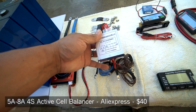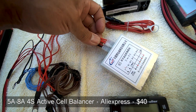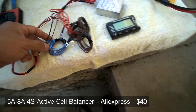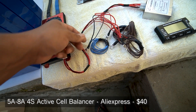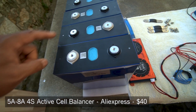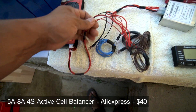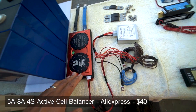This is an optional dedicated active cell balancer, about $30 to $40. It works similarly — it has five leads: a common negative and four positive wires for cell 1, cell 2, cell 3, and cell 4. They all get combined together. I also added two more leads for other things I'll connect later, and got them all crimped together into ring terminals. These ring terminals will connect to common negative, and then the first through fourth cell positives.